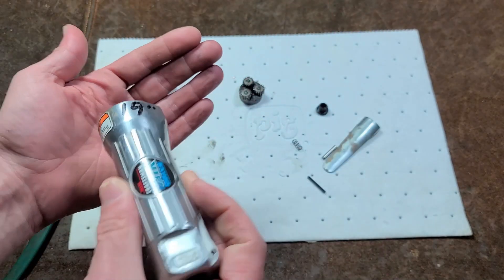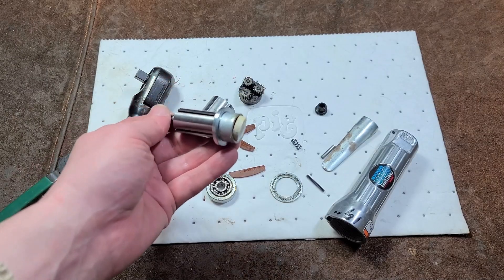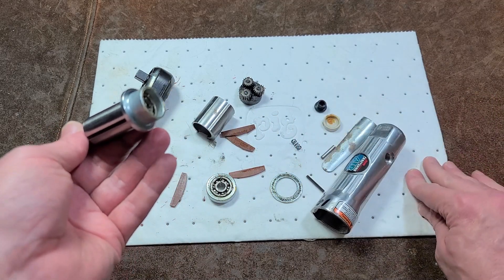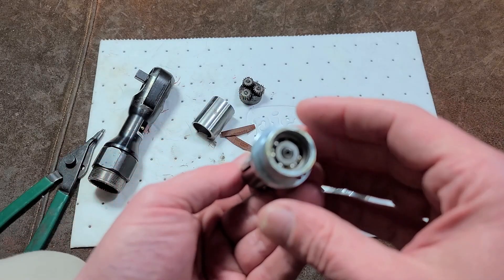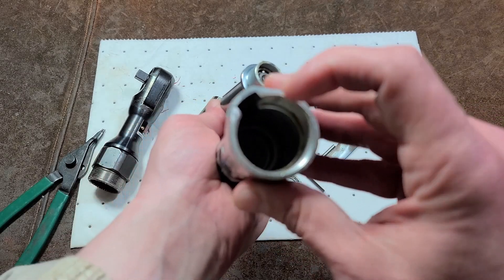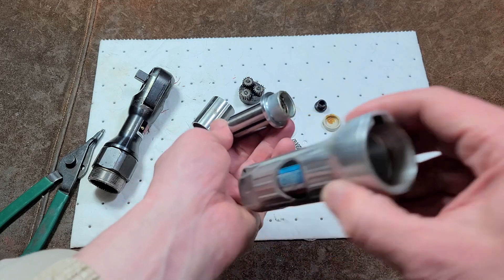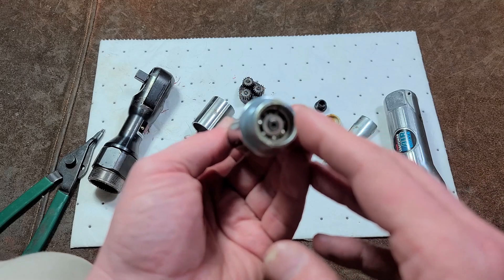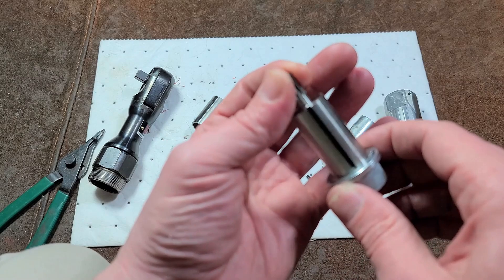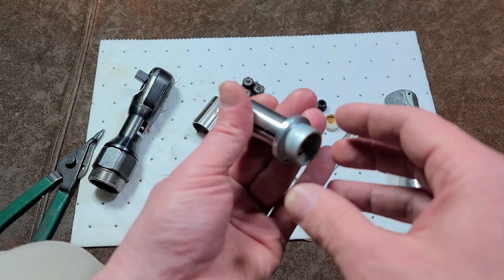Here's the ball bearing — usually these will just tap out, so I went to get a block of wood. We have a back bearing, and because there's a pass-through from the hole it's hard to see the bottom of the casing. That's where the air comes in and then exhausts out this little notch in the front. It has a little boot to protect the rear bearing. The oil, when you put it into an air tool, just starts circulating around through here.